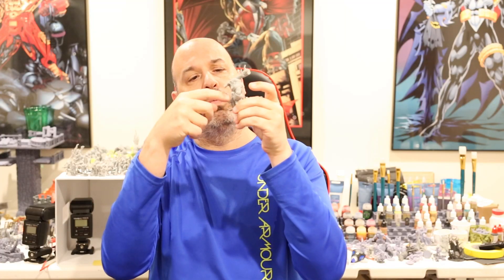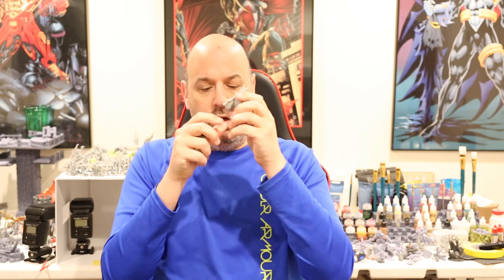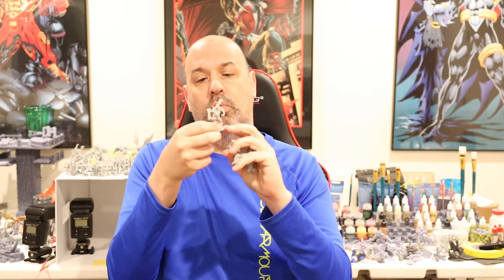If you look at my video on peel force — it's about peel force and the suction created when a print surface area is pulling off the FEP — think about this with a mini and with a cylinder. If you stand it upright, the largest cross-section is the fattest part of its body: a horizontal slice. That's the biggest print surface area, creating the most suction and peel force. If you tilt the model 45 degrees to the back, you almost double the diameter of that peel force area. From my other video, if you double the size of the printing area, you increase the peel force by 16 times.